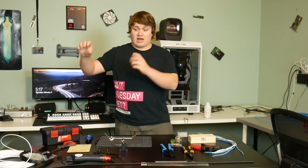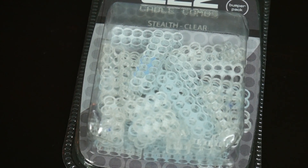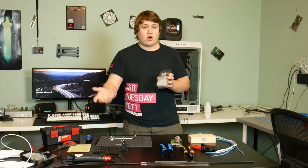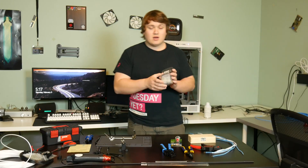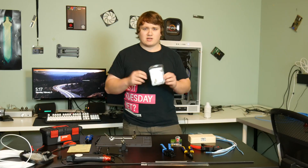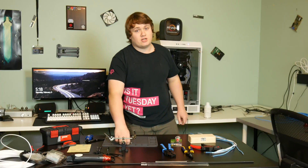The last cable-related item you'll need is cable combs. There are a couple different types and lots of colors. These ones here are EZ cable combs. This style is different from most — they're a full closed loop, so you have to put the cable combs on the cable before you assemble it into the ATX connector. Keep that in mind. I'd recommend this route because it looks cleaner and they never fall off. There are also U-shape ones you can insert the cable into. I ordered these from Performance PCs since Mainframe Customs was out of stock, but I'll link both.